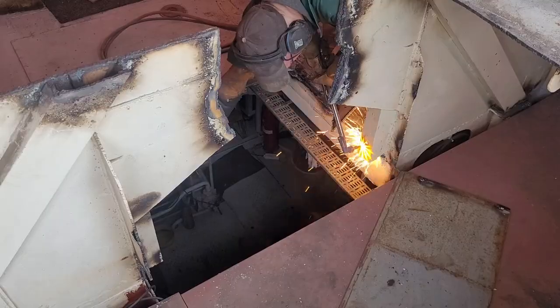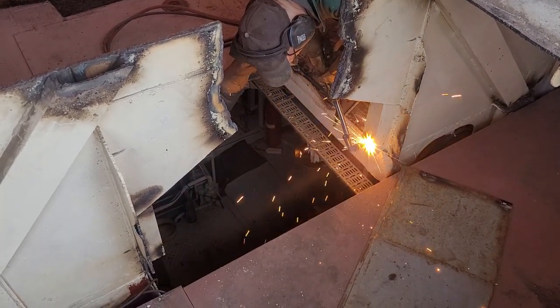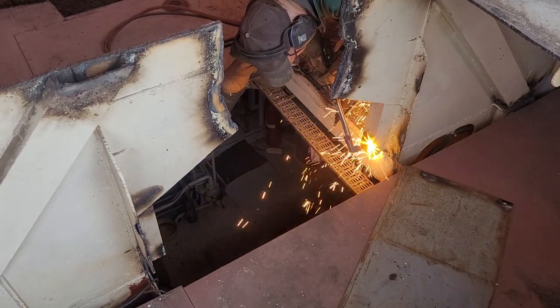Since the top part from the A-frame that the main mast was standing on was removed, there's now a big hole in the deck from the wheelhouse where you can look straight down into the engine room. Later, this will be the emergency escape from the engine room. So we will reuse the old escape hatch and install it in the deck from the new wheelhouse.